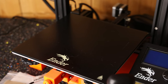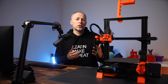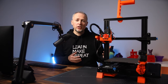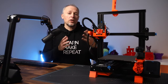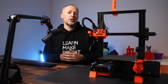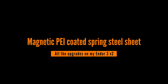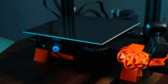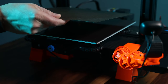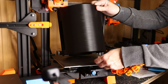I really don't like the coated glass plates that come with the Ender 3 V2. I wanted a solution that always works with all the materials I'm using and I wasn't really getting the results with the glass plate. I also wanted the same print surface on all of my printers. So I went with PEI coated magnetic flex plates on all of my printers. I'm super happy with this solution — prints stick super well during printing, and as soon as the printer cools down a little bit, you can pop any print off this plate super easily.